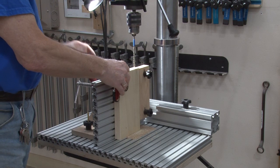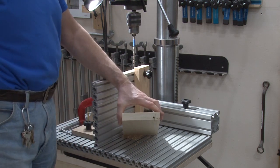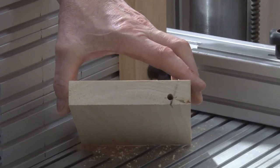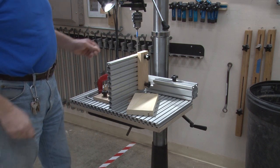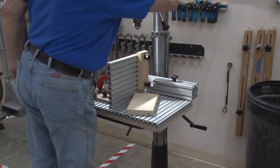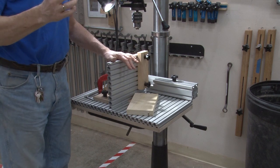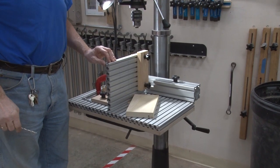At this point we're done. Unclamp your workpiece, put the clamp aside, remove your piece, and as you can see, there is your hole all ready to go. When you're done and you've removed your workpiece, make sure to remove the drill bit and put the key back. Vacuum everything up, clean it, put the drill bit away, put the fixture back on the table. Make sure that your indexing pin is put back where it belongs as well, and you're done.